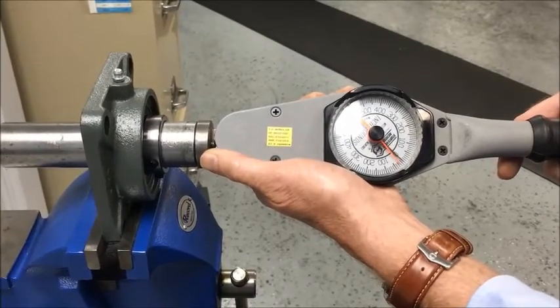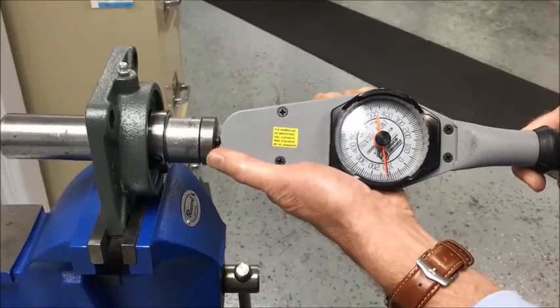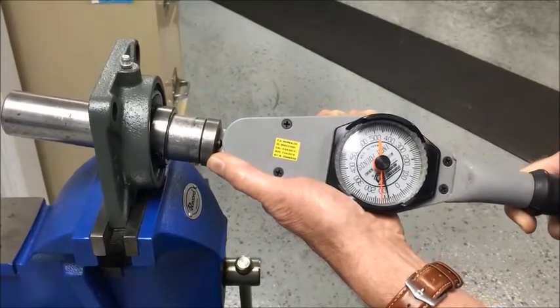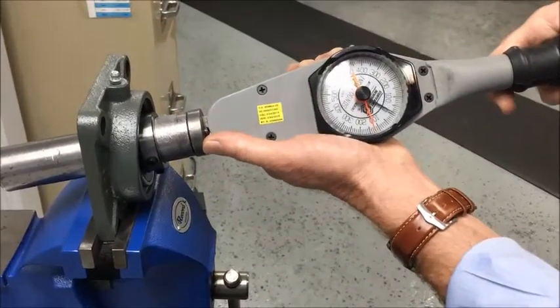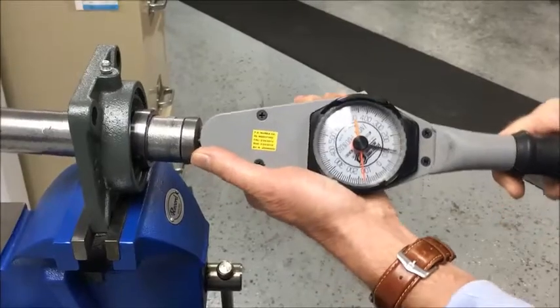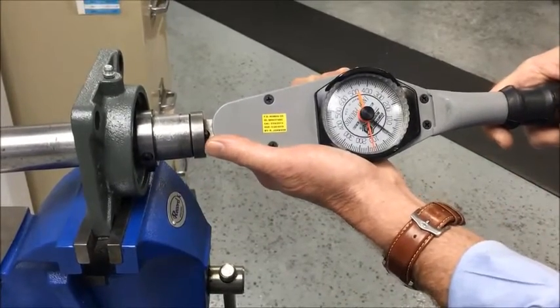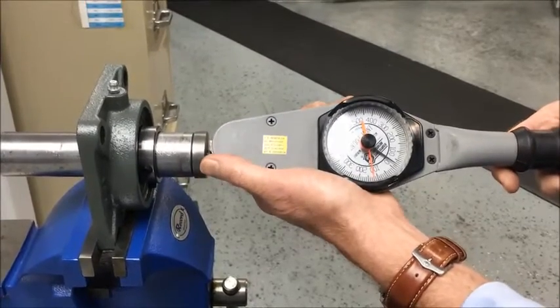This insert installed in the housing — let's just measure it. With a torque wrench, you can see about 120 inch pounds — very normal and typical. You can see I'm not fighting as that alignment is measured, but that would be the static alignment that the shaft could take during the installation, allowing the balls to run square in the ball path.